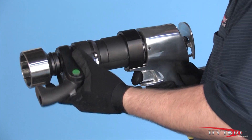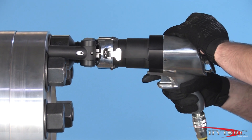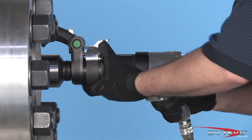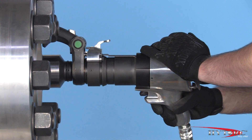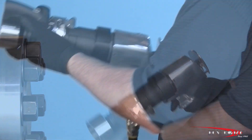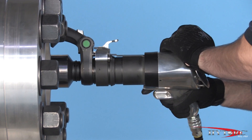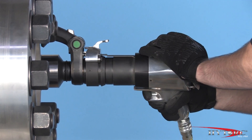Flip the speed selection arm into the torquing position by rotating it into the plane of the nut. Engage the nut and position the arm against the next nut over, keeping in mind that the arm will turn counterclockwise as the socket turns clockwise. In order to protect the operator from inadvertently having his hands in the danger zone near the socket, the tool will not operate in the low-speed power position until the safety lever switch at the rear of the tool is depressed and held. Never touch the reaction arm or the reaction surfaces while the tool is running. Hold the trigger in until the tool stalls and will no longer advance the socket. You have applied 585 foot-pounds of torque to that nut.